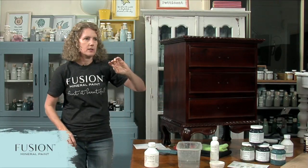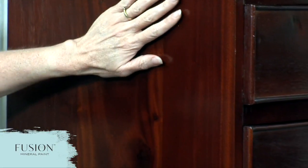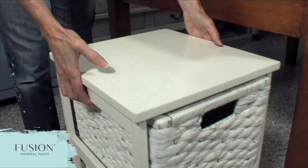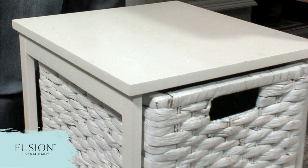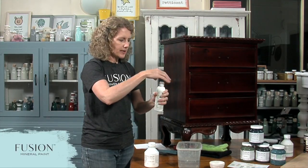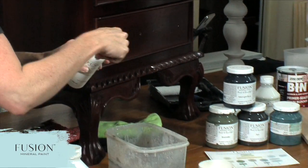There are a couple of other times I might use UltraGrip — one of them is for a piece like this that has quite a shiny surface. I've just started sanding a little bit here to de-gloss it. The other example I want to show you is this piece of furniture that's actually laminate on top. To clean that up — it's got sticky tape marks and all sorts of things — what our prep guide suggests is using TSP. Fusion's TSP comes in this little bottle; it's a phosphate-free organic degreaser. You only need about two capfuls per litre, so I'm using one capful for about 500ml. That's all you need to clean and prep your piece.